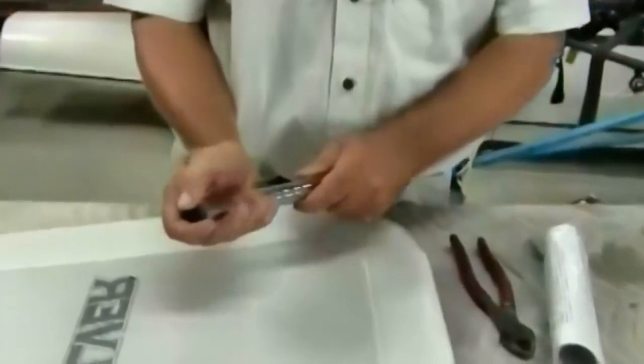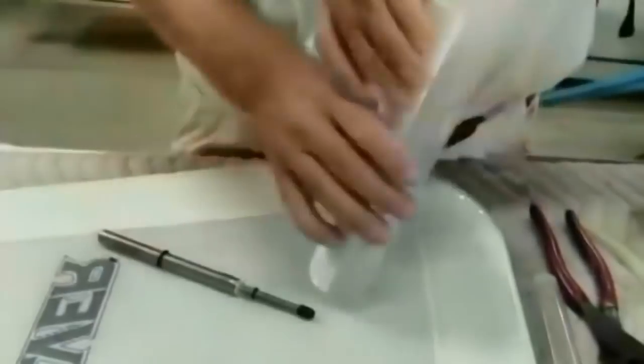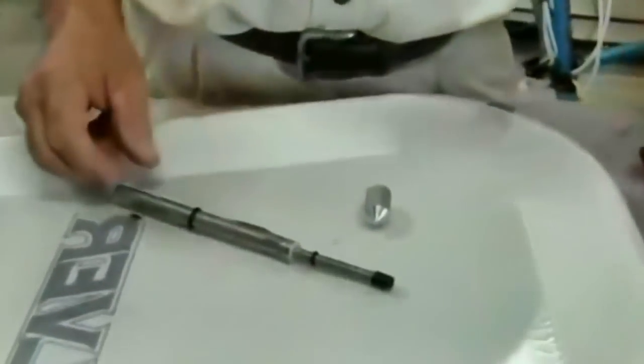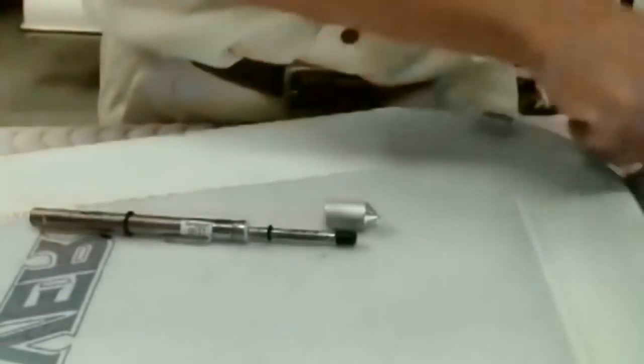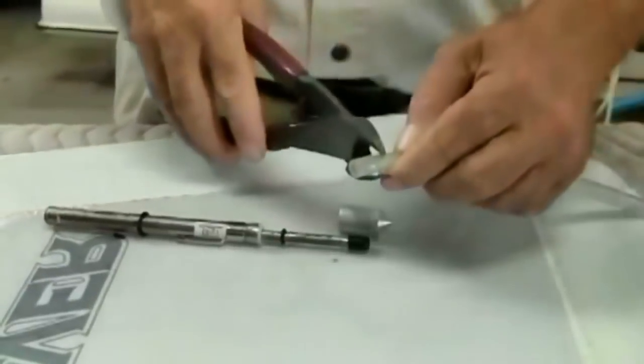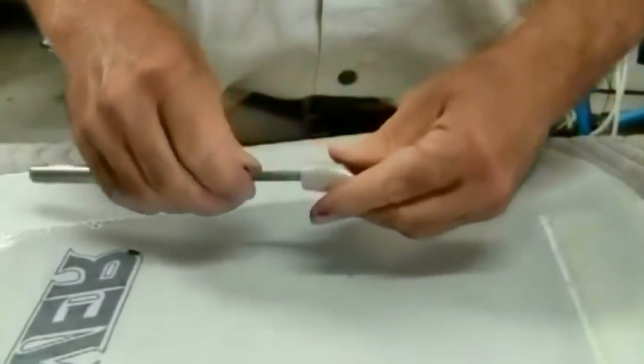In this little segment, we're going to show how to use a fabric tester. The part we're going to use is the Quicksilver fabric tester, part number 60033. When you get the fabric tester, it comes with everything you need. It's a two-part component: the plunger and the tip that we use to push through the fabric. The tip is a little loose over the rubber, so we take a little piece of quarter-inch fuel line, cut it about a half inch long, slide it over the tip to take up space and create a tight fit onto the plunger.